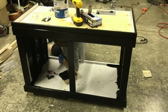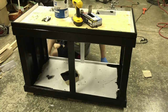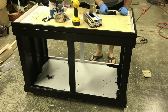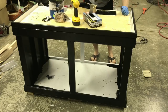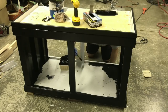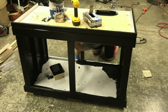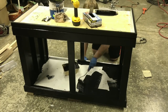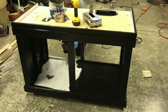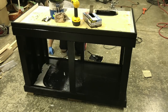As you can see it's coming together — we are getting close. All of the tedious painting of the corners and small pieces of lumber are almost done. Now comes getting the last bit of tedious stuff done and then working on the bottom. That's the easy part — using the roller. I definitely like a brush on all the small stuff because I want a nice thick coat of paint to seal it well. Setting up a fan for airflow at night helped it dry really quick.